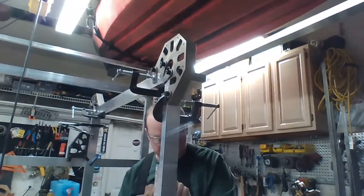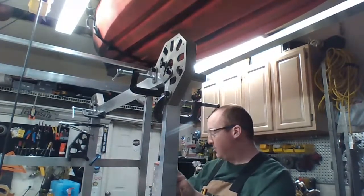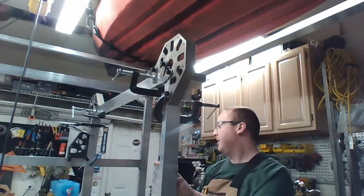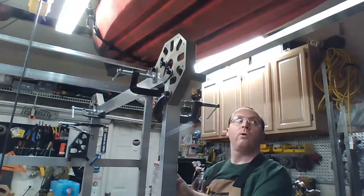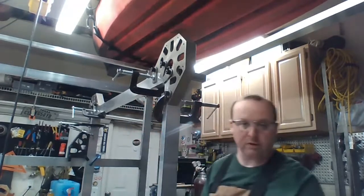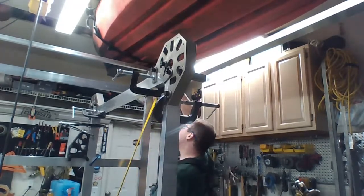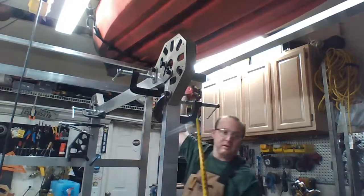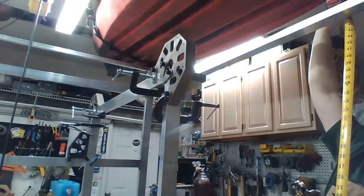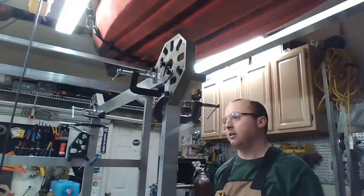I'm relatively confident on the passenger side because it's clamped to the side of the structure. I can't move it. Everything's going to be happening on this side. Only thing I can think of is my camper is not square, which my camper's not square. So here's 46 and 1/16. 45 and 7/8. So we got a 3/16 inch drop side to side.